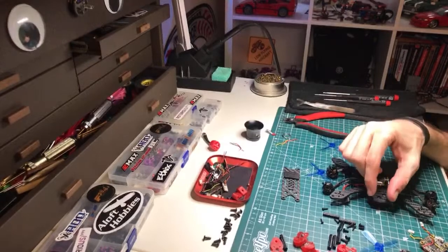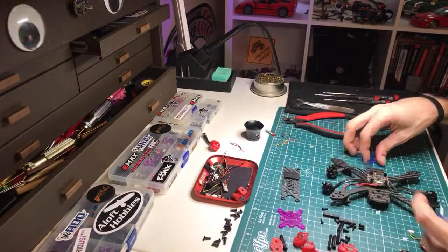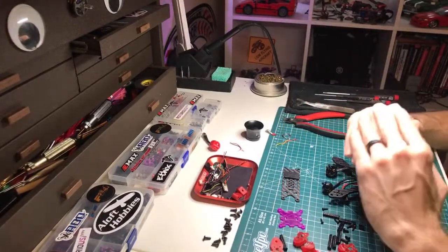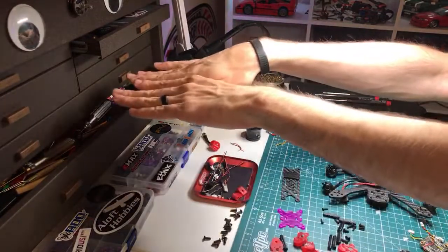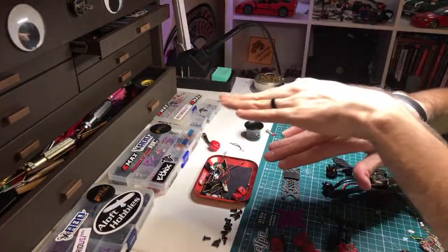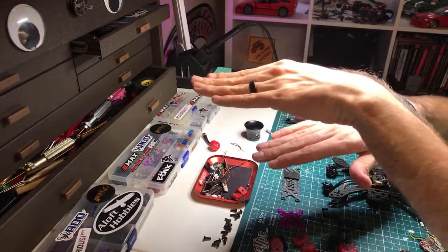Soft mounting just the camera, which some of the other microframe makers have been doing, does absolutely nothing because the camera doesn't weigh enough. The whole point of the clean dirty system is that you put as much mass as possible on the clean plate so that it just wants to stay in place and cruise through the sky. And then your dirty plate can do whatever the hell it wants. So believe it or not, adding mass to the clean plate, like going from a 650 to an 850 battery, will noticeably make the footage smoother.